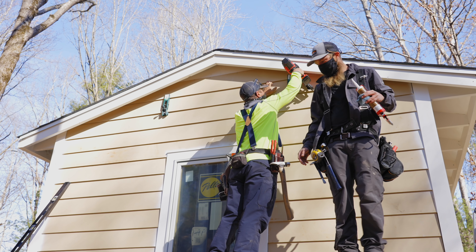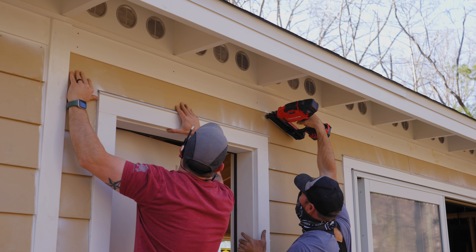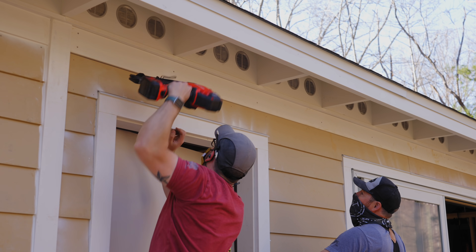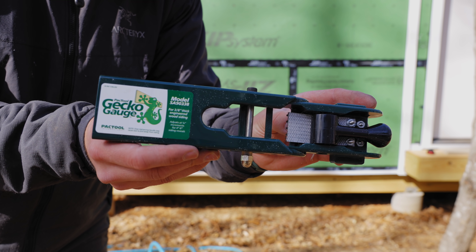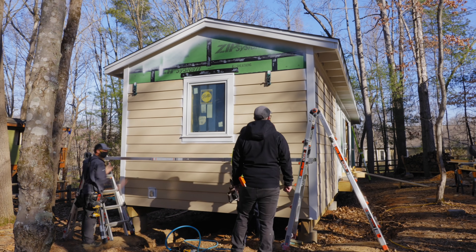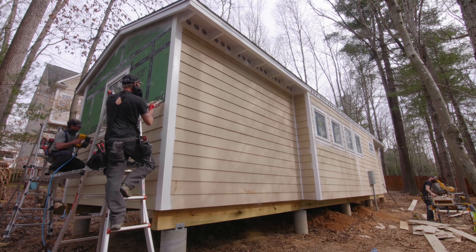The other nailer we used quite a bit was a finish nailer, and this was a battery powered nailer for tacking boards in areas where the siding nailer wouldn't fit. We also tacked the corners of this lap siding to help secure those down to the house, using two-and-a-half-inch galvanized finish nails. I would also recommend two more jigs: these Gecko gauges, which were totally indispensable in my opinion, and this Simple Sider. Also a good walk board or scaffolding setup because a typical ladder leaning against the wall makes installing lap siding very difficult.